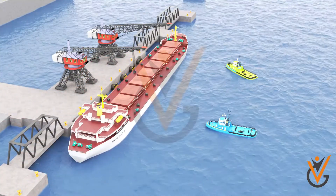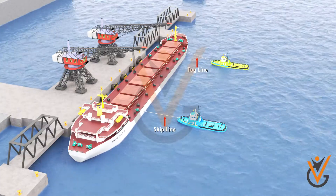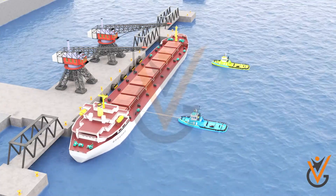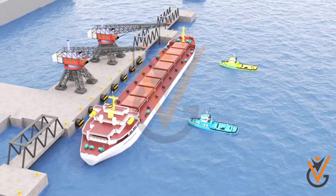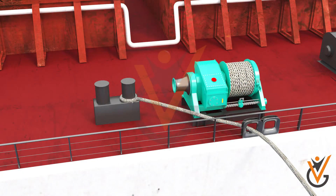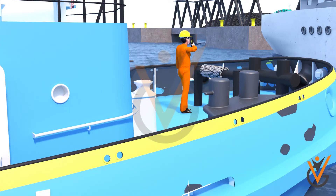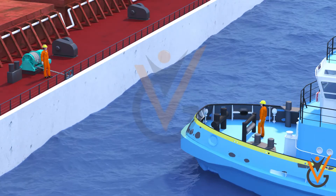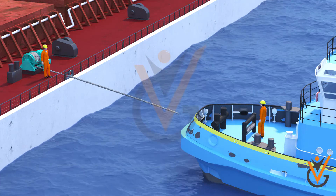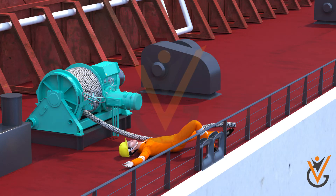Communication between the bridge and the mooring station is done by means of a walkie-talkie. Tugs assist in berthing and unberthing the vessel. When tugs are used, either the tug's or the ship's line can be used for turning, towing, pulling the vessel away from the berth, or pushing the vessel alongside for berthing. The lines are made fast to the bollard. Good communication is required between the tug master and ship staff to ensure the correct location and length of line is used. The tug line should be lowered in a controlled manner, and ship staff should keep well clear of the tug line when the tug is pulling, to avoid danger if the rope parts.